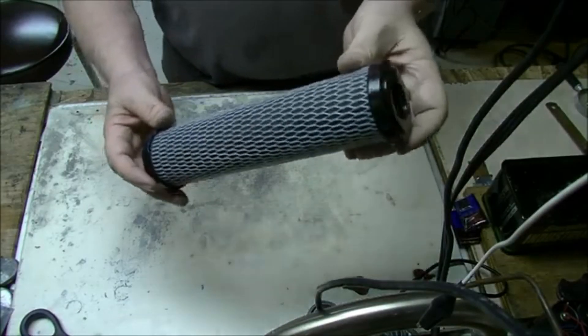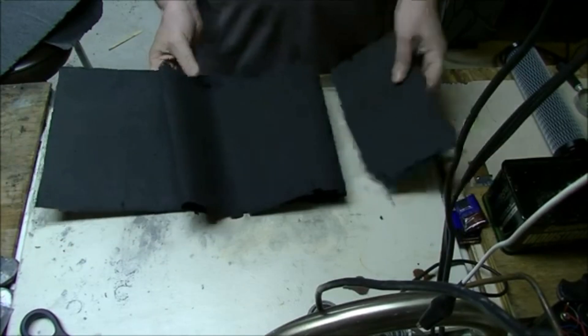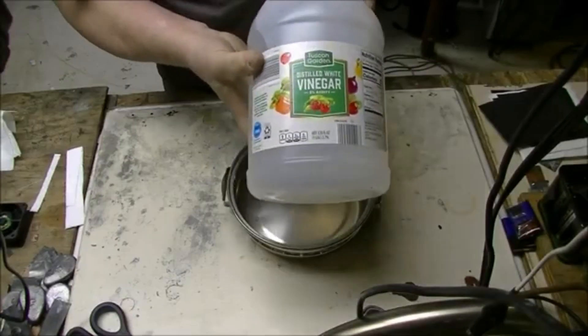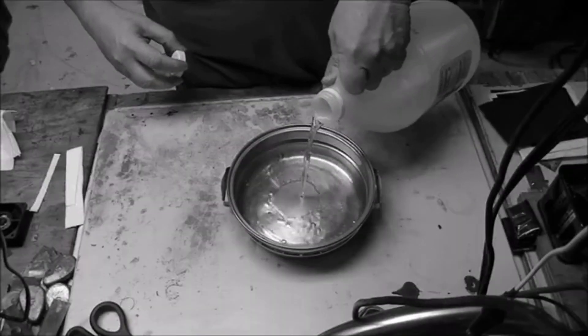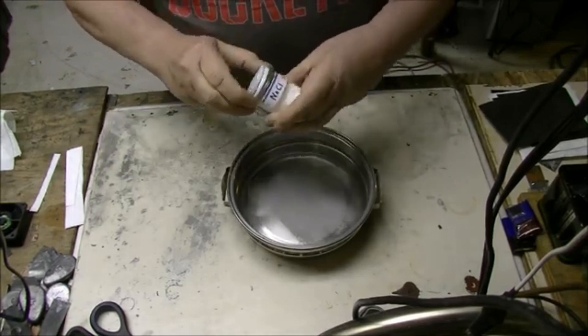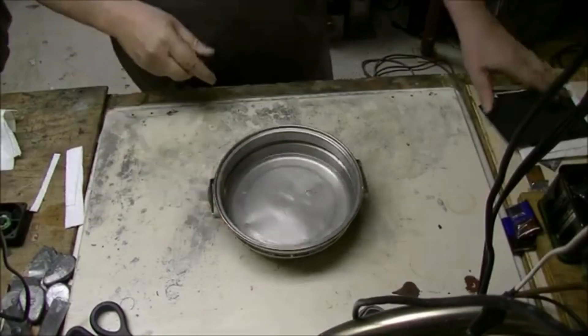Here's my attempt at making a supercapacitor. I don't know how super it is, but that's a water filter I use in my house — it has felt paper in it. After I get done using them I tear them apart and take the paper out. For this I cut them into squares, then I use heavy duty aluminum foil — it wasn't quite strong enough, I need something better for my current collector. Paper towels in between, and distilled vinegar and regular table salt mixed together for the electrolyte. That felt seems to work alright, it's just paper with carbon on it. I soaked that in the salt and vinegar solution.